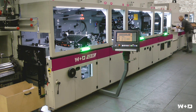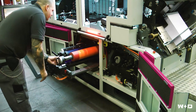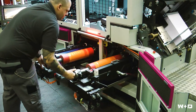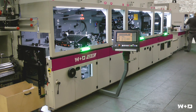The W&D 628BC is now also available as a blank-fed version with integrated quick-change 2-over-1 servo flexo printers. This new W&D machine design produces envelopes, self-mailers, and a secure content postcard type direct mail product from both rectangular sheets and die cuts. The 628BC can also convert digital or offset pre-printed sheets.